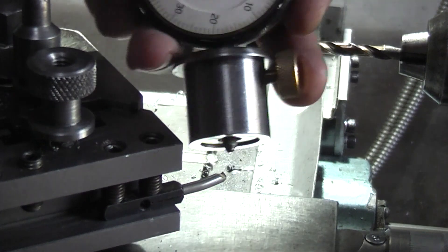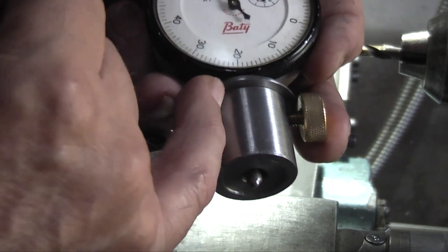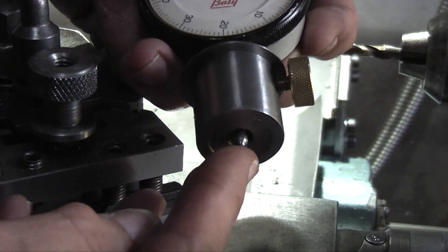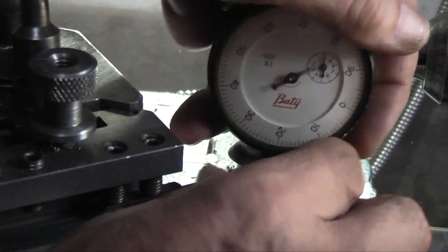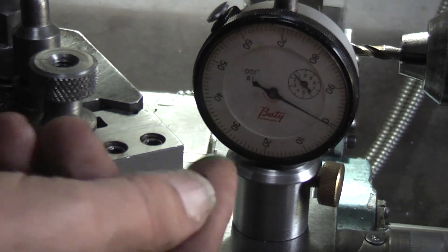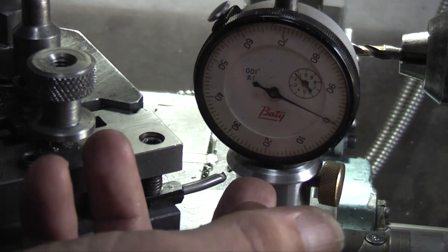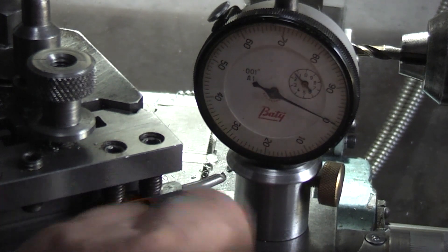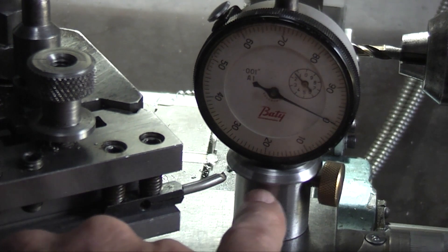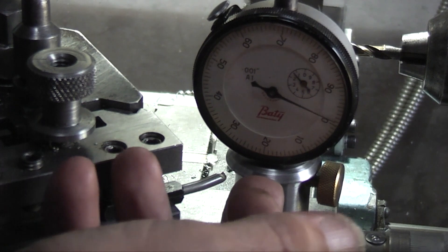This is just made out of a dial indicator, a piece of steel turned, and a second piece of steel with a lip on it, so the dial indicator comes through and is locked in position with this knurled knob. When you put it on the top of your slide it moves it round. It doesn't matter where it is on the dial — you are just looking for movement. So once the tool comes up and lifts this up, the dial indicator will move, and you know that this is then level with the tool, or at the same height as the tool. That block underneath was machined so that the bottom of this face is on centre line with the chuck. So once my tool touches underneath and lifts this, I know it's on centre line.